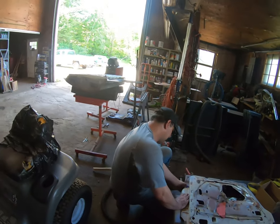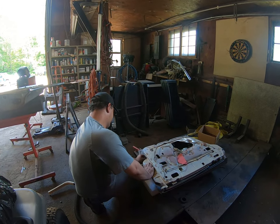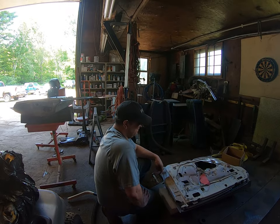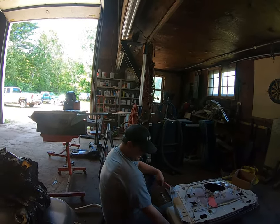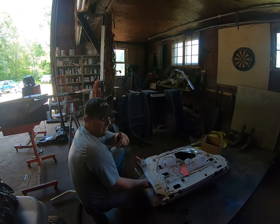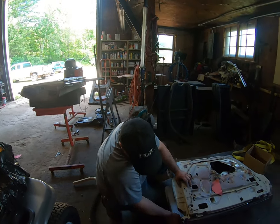Should have brought over that roll of masking paper. So you could mask the finish sides of the doors off. I think if I drape some of that plastic, I can bring it right down to the base. I'm gonna outline where the paint is and tape it, and then I'll put the masking plastic over there. I got a big roll of it. Yeah, that'll probably work, rather than try and mess with newspapers and everything else.